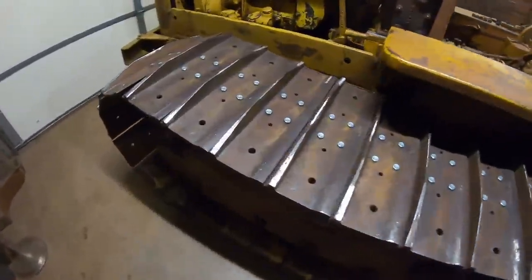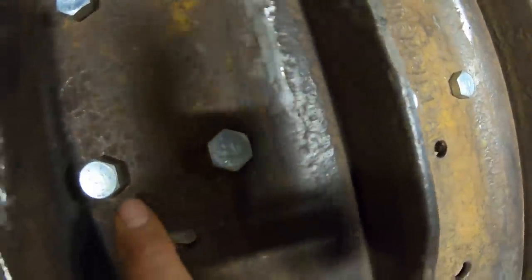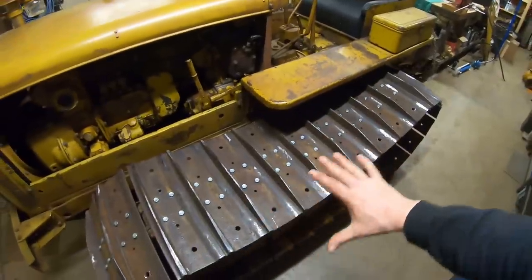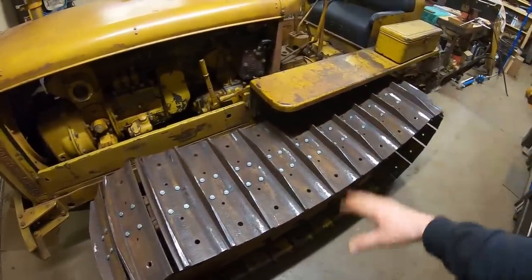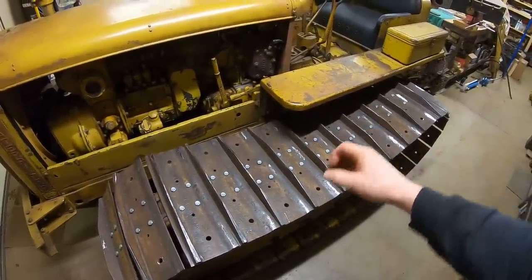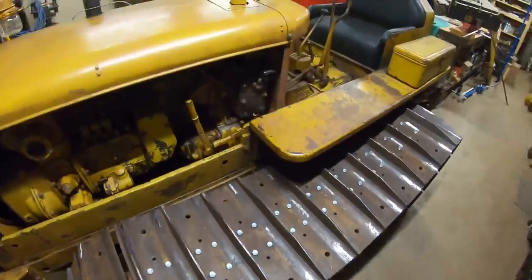This side is wrapped up, front dirt guard back in place. I do enjoy looking at the CAT logos on all of these bolts all the way down the line — there is a certain method to the madness. Having them all arranged facing the same direction lets you know at a glance if any have started to loosen up. If any of those logos are off-kilter with the rest, you know you have a track pad that needs attention. Plus, it leads to better and more restful sleep.